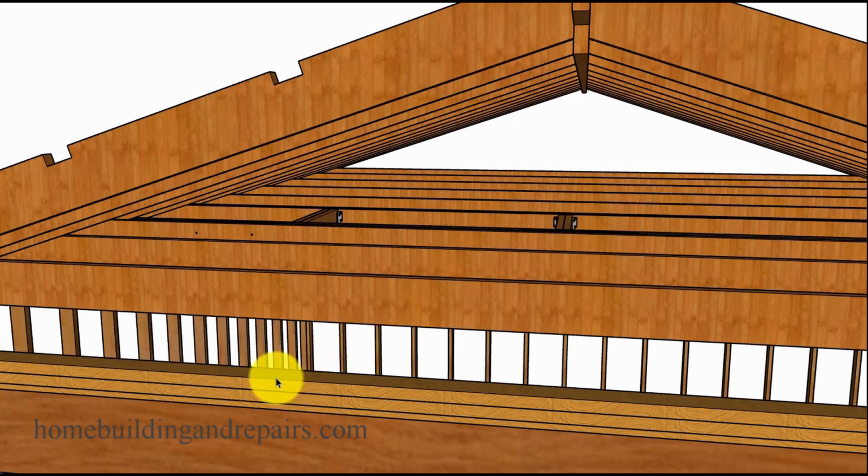I know a lot of people move the opening off to the side and then have the stairway coming down in this direction to where it sits on the garage floor. You would walk up the stairs like this, and then you don't have any headroom, or it's a safety hazard because you've got to crawl over a little bit. So keep that in mind. The location of the stair head out is going to be critical for headroom in the attic if that's going to be a problem.